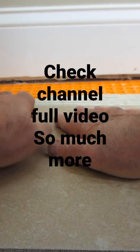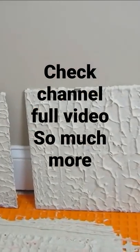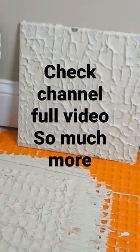Now the clean tile — pick this up — complete coverage. It just goes to show the bigger the tile, the bigger the trowel you need. So that's just the basics of how to select the trowel. You need to use the correct trowel for good coverage.